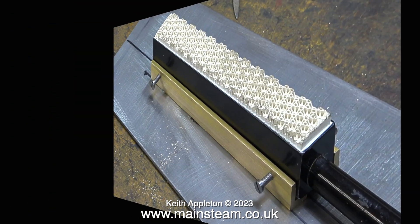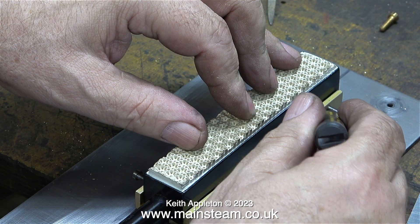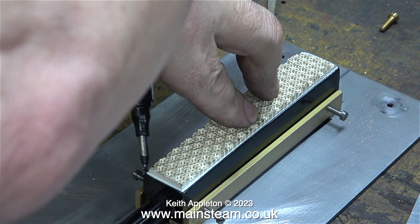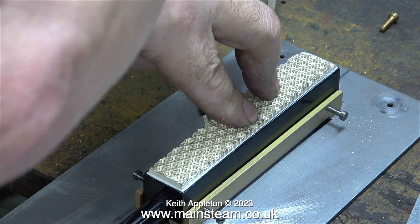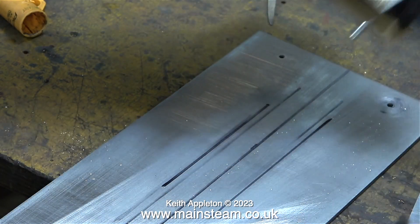The simplest method to mount the burner is to just use these pieces of brass angle the other way around and bolt them through the steel base plate. I'm doing it a different way — not only are the two pieces of brass angle the other way around, I'm going to elevate them. This is a Bix type gas burner and they do tend to overheat. As the video progresses it will become apparent what I'm doing, and right at the end I modify the method. It's a bit of an experiment.